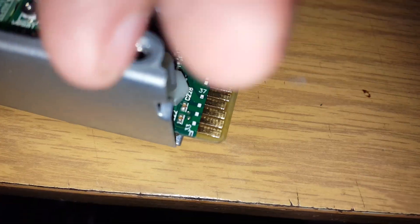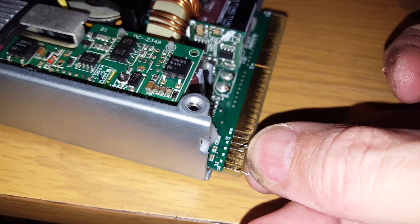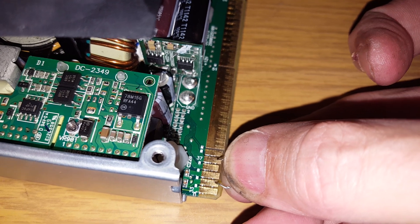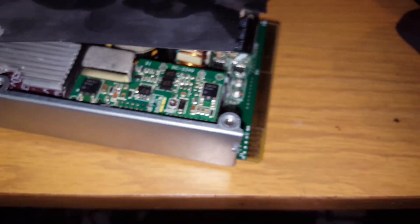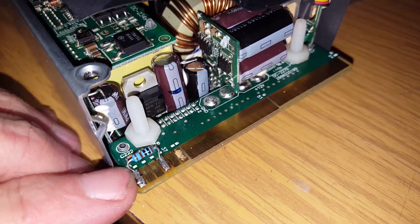This should have been the first step, but I've done so many of these I skipped it. You want to get something like liquid solder flux, put a little bit on these pins, and then you're going to attach a 1k ohm resistor between pin 33 and pin 36. You see this one here — it says 37 — and it's the short one right next to it. So you want to jumper across that with this resistor. I'll put the camera down to do this.